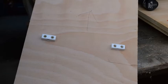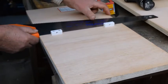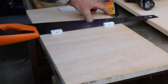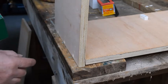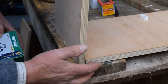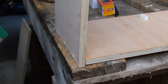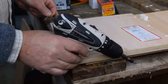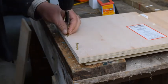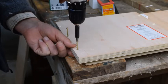We'll do the other side and then we'll be ready to put the cabinet together. If you want to be sure you've got the block level, you can always put your trusty saw across again and use that as your guide — or just put a line across and then you've got an accurate guide to where to put your block. So we now put our base up against — flush at the front. We call this the front of the cabinet. It's best to keep one side really nice and flush, just in case the other side's a bit out. Then we're going to put in these 45mm screws to hold it all together. You'll probably find it easier to just start the screws in your pre-drilled holes — make sure you go in from the countersunk side. Just make sure they don't go right the way through to the other end, because otherwise the boards won't join up together very accurately.